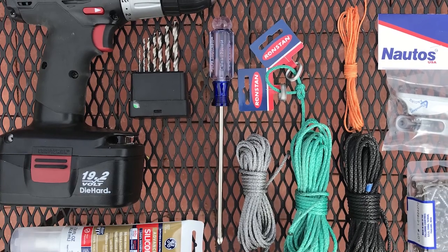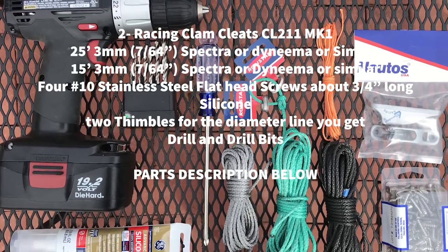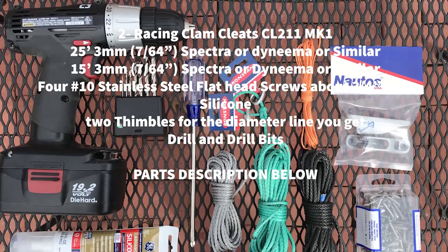I'm also going to leave the products in the description so you know which parts and lines to use. The outhaul and cunningham are basically two separate systems — the outhaul controls the bottom and the cunningham controls the luff of the sail. You can use two cam cleats mounted to the boom, non-stretch racing line about 3mm (7/64 inches) in diameter, and optional thimbles to reduce friction and make adjustments easier and smoother.